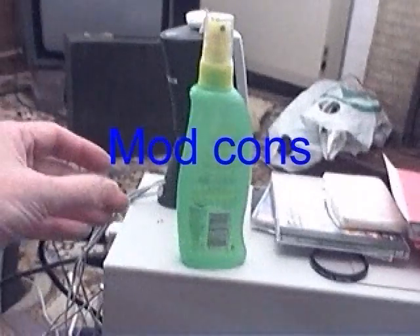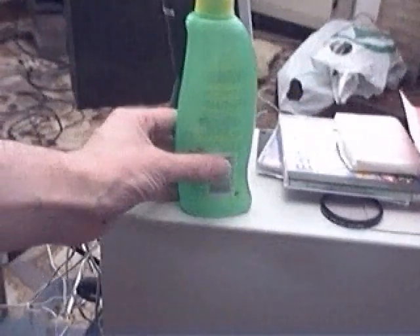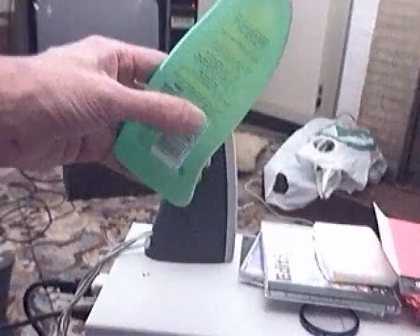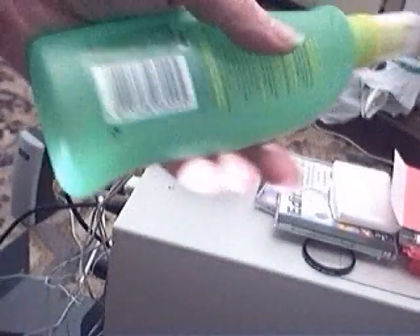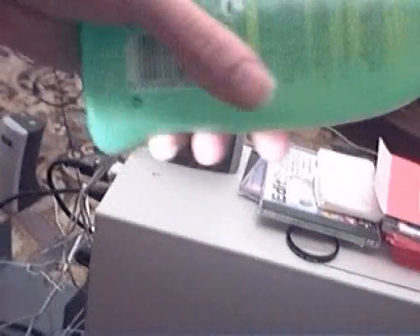Now this is the design I've come up with. Basically, it's a hair conditioning bottle, and it fulfills all the requirements which I specified. In other words, it needed a trough which was of reasonable size, and it didn't have to have square corners — otherwise seed would collect and possibly not flush out, and over a period of time would undoubtedly start to rot.